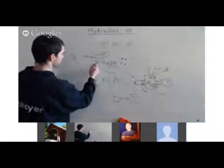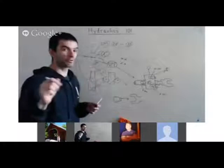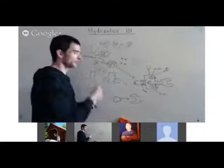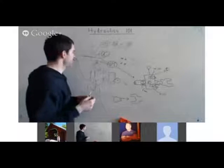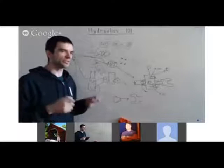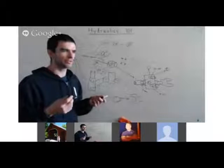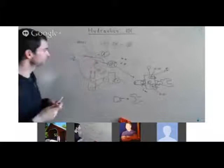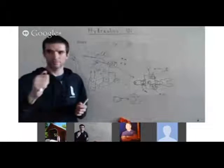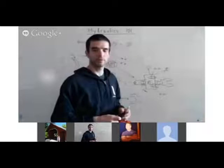Remember the other part: motor versus cylinder type of valve. When it says motor, it will actually tell you it's a motor spool valve; for the cylinder it will tell you it's a cylinder spool valve. Once you identify the 30 or 20 gallon version, there's typically only one type — just select one. We typically use the Prince brand of valve. These valves can be single, double spool, triple, to however many you want.